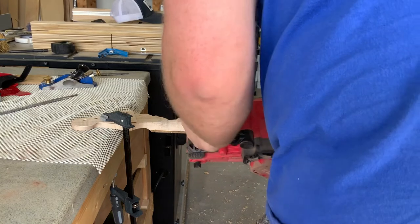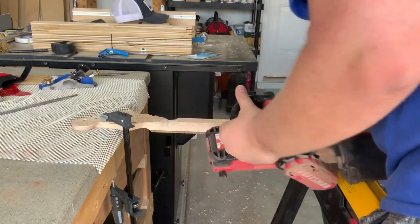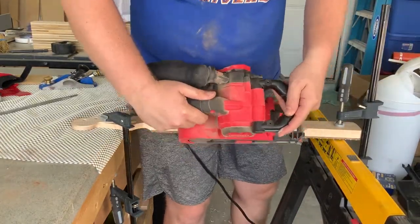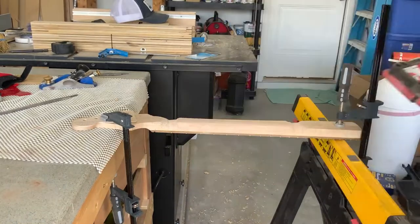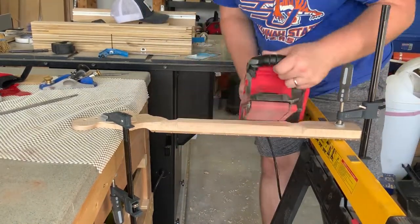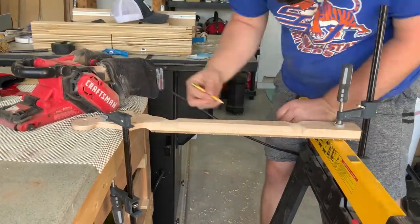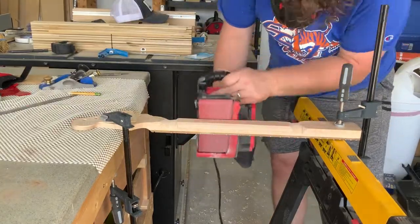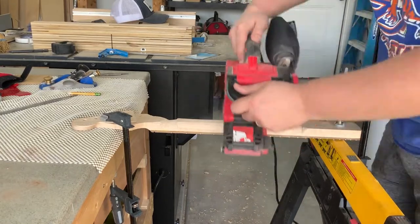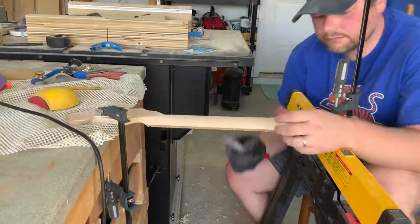All right, so I had started working at the neck a little bit with my block plane and with the Surform plane and with the rasps, but my arms got tired, and I had done this before with a belt sander, and I said, you know what, I'm going to do it again. And that's what I'm doing here. I've got the first facets on the corners with the block plane, the Surform plane and the rasp. But then after I got those first facets in, I just went with the belt sander. And you see me working it from different angles.